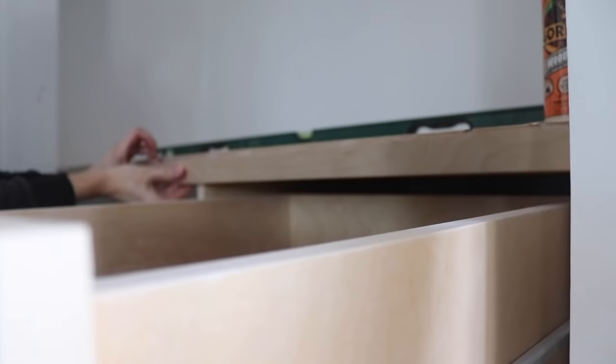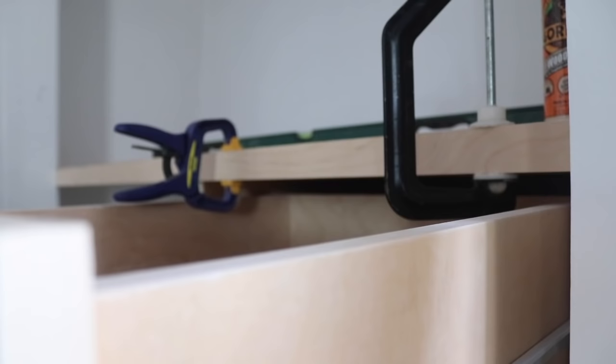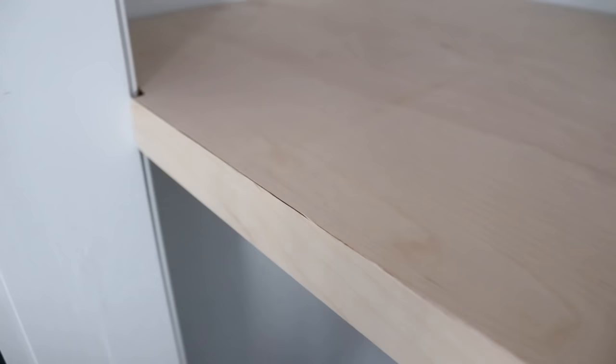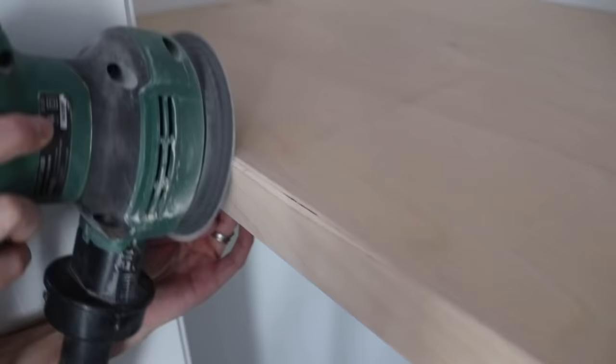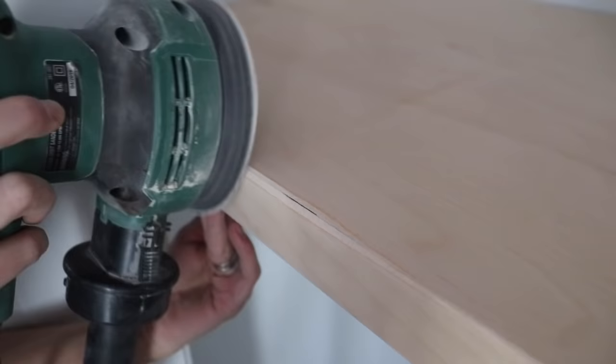I didn't want to nail this together and try to fill nail holes since this strip is going to be so visible on the front face of the closet. So instead I decided to glue using Gorilla Glue, then clamped it up for about an hour. Then on the 45-degree angle seam where there was a little gap, I used my trick with the random orbital sander — where you sand off that edge and kind of mush the wood into itself so that the seam closes and the miter kind of disappears, even without wood filler. This worked pretty well, but it definitely works better with solid wood instead of plywood, because some discoloration from the next layer of plywood started to show through. After I whitewashed that area it was pretty discreet — just a spot I'll have to chalk up to a DIY mark.